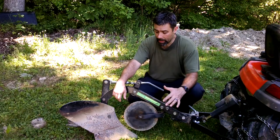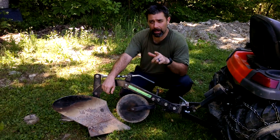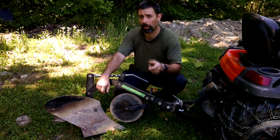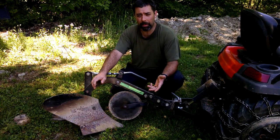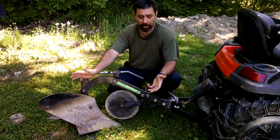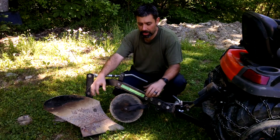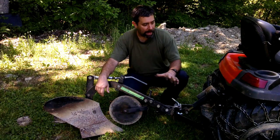You just have to keep that in mind if you're doing it for drainage. Today I've got this hooked up because we're actually going to be digging a trench all the way from the garden to the house to bury water lines, so we have water pressure all the way up at the garden instead of trucking our water back and forth like we have the last few years. I'm not using this water in winter, so I don't need to go to 18 inches depth — which this device isn't capable of anyway. But it will bury the line six to eight inches even with the rocks, and that'll be just fine. I'll lay my line in there, push the dirt back over, step on it, and I'm done.